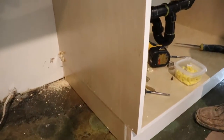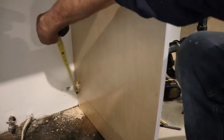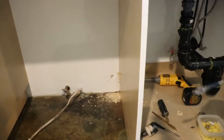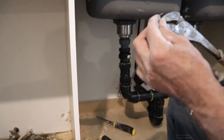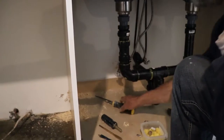Now I'm just gonna take my measurement to see if I have to dig a little bit more inside the base — yeah, I'm gonna have to go a little bit deeper, otherwise I would not have clearance for this pipe. Another tool I could use here is a reciprocating saw, and I would cut this pretty easily too. I just make sure there's nothing there, otherwise I'd make a hole in my pipe.